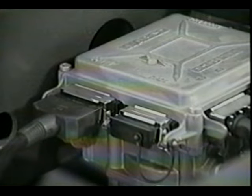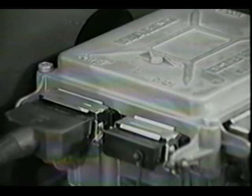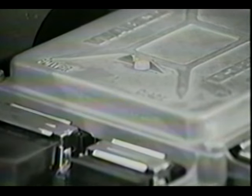The expert mode uses the same LED and warning lamp capabilities to blink out fault information. But the procedure for activating expert mode is different. If using the diagnostic tool, install it to begin the procedure. Apply power to the ECU as we showed you earlier. Have a paper and pencil handy for recording codes.